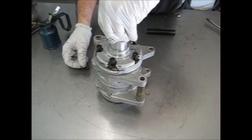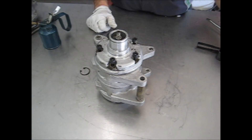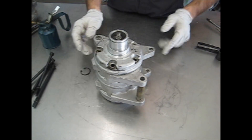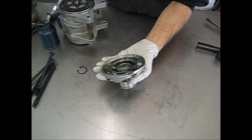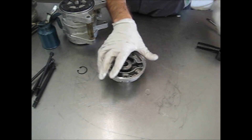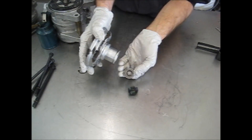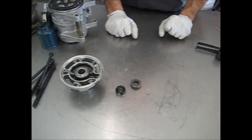Now most likely you're not going to have these tools, so how are you going to work around it? It's not a big deal — it's just like doing it as the other type compressor. Remove your front cylinder head bolts. This will break the seal on the unit, so you're going to need to reseal the entire unit; purchase the correct seal kit for the body as well. Then lift off the entire front housing and flip it over. You'll now have access to drive that seal out from the back. You'll have to take the snap ring out, and you're going to pretty much destroy the seal pulling it out. You can tap it down and knock the front metal part out, and the carbon part will fall out as well.